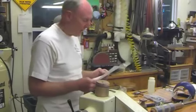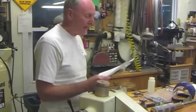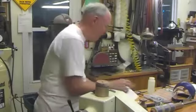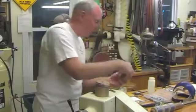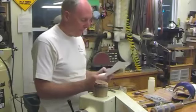If the pith is to be in the piece, this applies to greenwood, obviously, you should center that at the top so that it gets removed as the center of the neck. This would be the neck here, and so the pith should be right here, and you want to drill a hole. One thing I find is walnut is extremely forgiving, even if you leave the pith in the piece, for a green one.